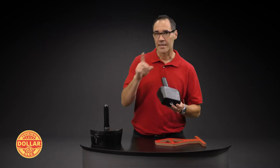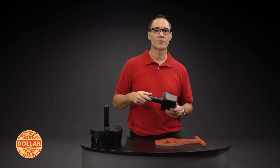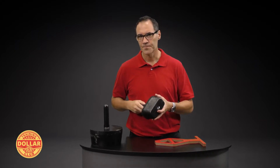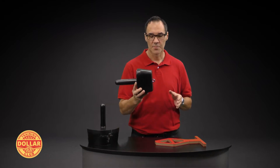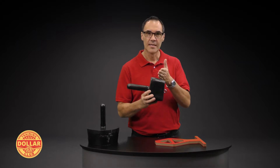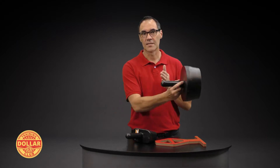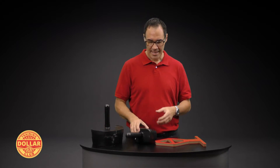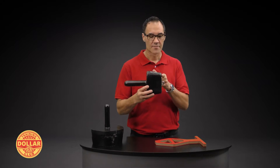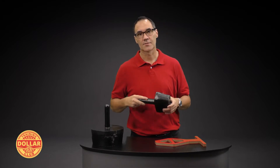Connected on all sides, we find this opening and try to push the torso probe through using just enough pressure — it should slide right through or be blocked. The torso probe must either get stuck here or up to here. If it passes through the opening, then our head probe must also pass through. If it stops anywhere up to this edge, from here on up it's a pass — meaning the torso cannot pass through.